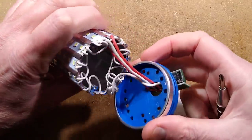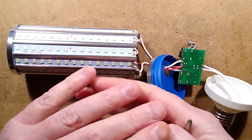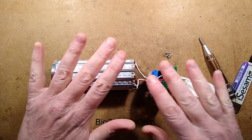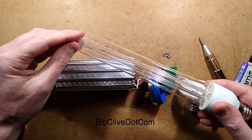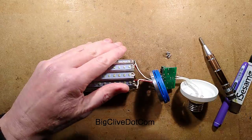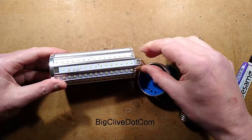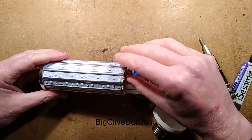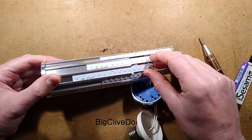They're going to get all the theater of a UV light, but with the blue light and lighting the whole room, and they get the warnings, and the listings say they've copied the information you get from this, including some of them saying that you'll get ozone, which you don't, and a burning smell, which you don't. This does create that effect. They give you all the warnings about not going near the lamps, and near the rooms and exposing yourself. But in reality, it's just theatre, it's drama, just to give the illusion that it is a real UVC lamp.